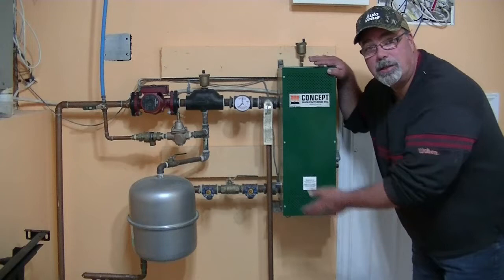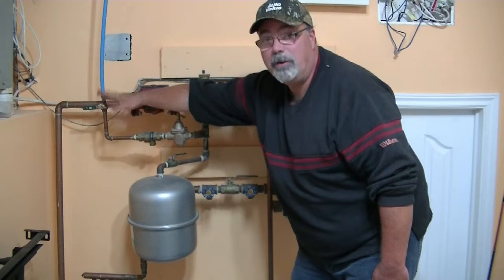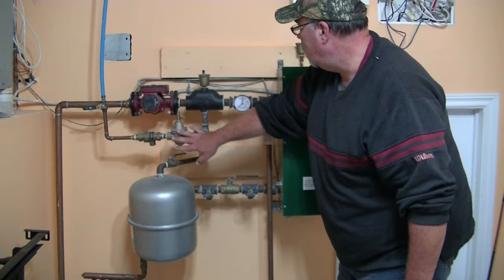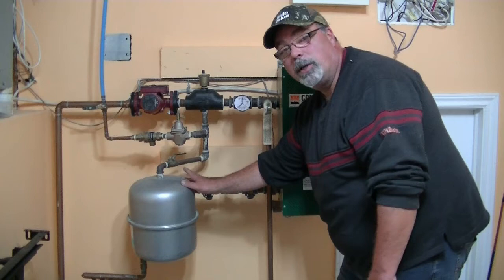So I'm squatting over here. We are going to discuss this — it is a hot water boiler. Over here we'll start with the fresh water. This is a fresh water line. This is in the off position, because you only put the water into the system. Every year I've been opening that and putting fresh water in it, so bonus on that one. So we come down here — this is a pressure relief valve. The water comes in and then we come into a split with another pressure valve up here. Now all systems will have this. All systems will also have a pump, and this silver contraption here is an overflow.